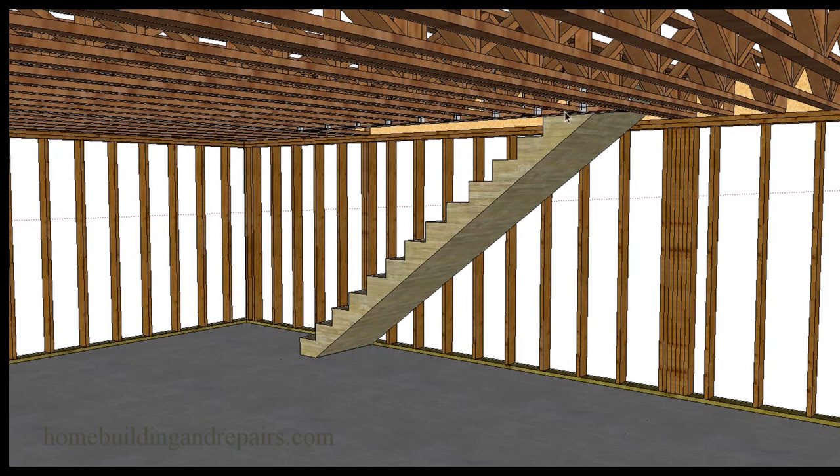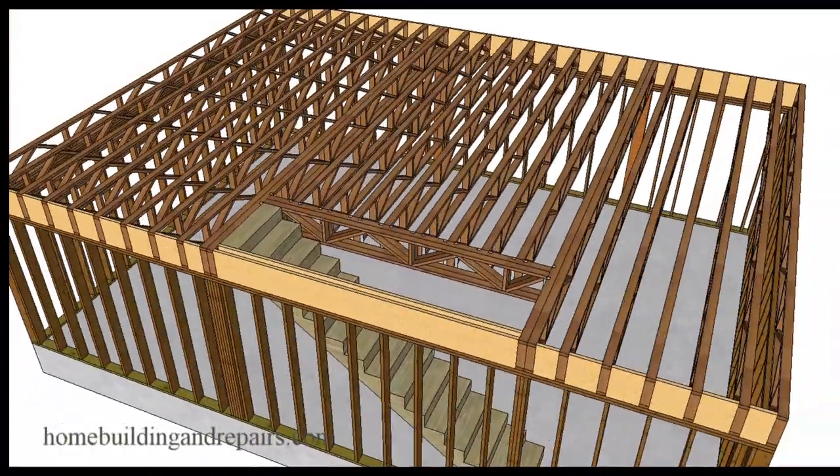The individual said they were not going to build a wall in there, and if that's the case you could probably do something like this: a double floor truss all the way across, another double floor truss all the way across, and a double floor truss here to support this. We did a lot of framing like this before, but again this all depends upon the product manufacturer and the span of the floor joist.